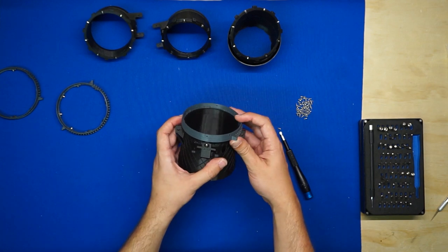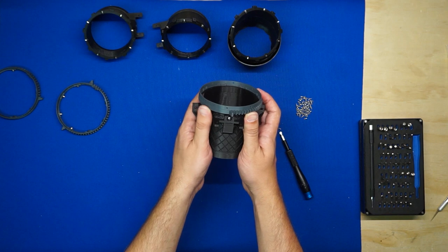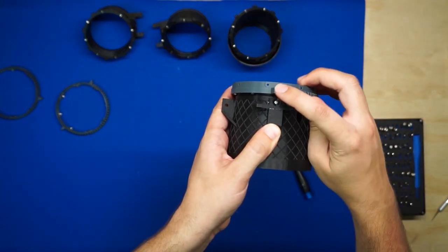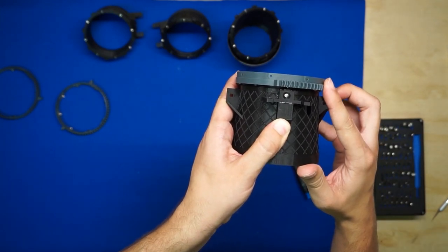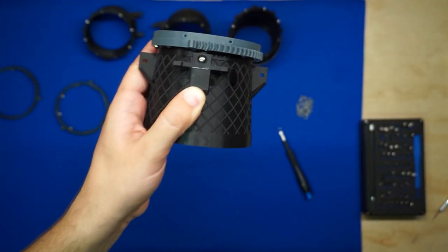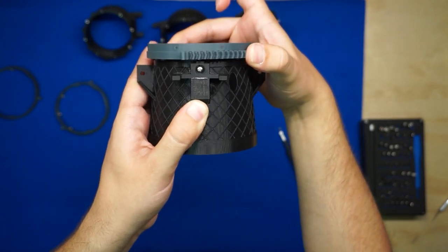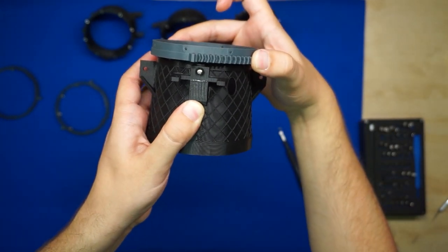But once you've got this popped over the edge here, go ahead and align it such that this stopper on the backside of this row of teeth is just to the left, from my point of view here, of the servo mount. So that's where the row of teeth is going to start, and then this being section 1 will rotate this way when it transitions to the VTOL configuration.